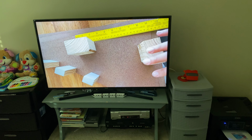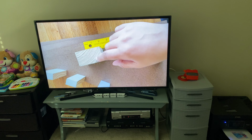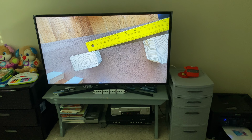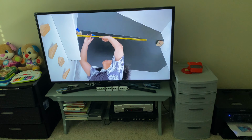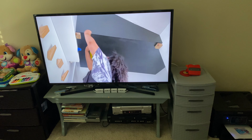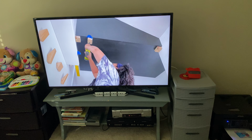Okay, I'm measuring out. I already have this block up, so where to put this block, because this will go into the stud, and then I'll nail gun it and brad nail it into here. I used some heavy duty connector screws that were 3 inches long to connect the block into the stud.